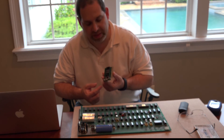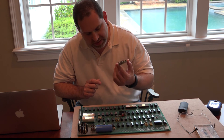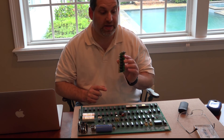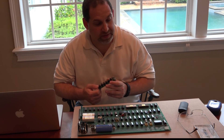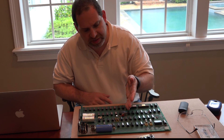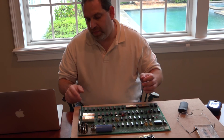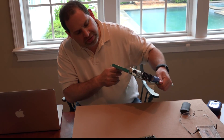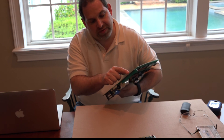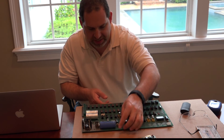There are different types of transistors than would normally be there, and we've got a date of 76-23 on the cassette adapter, and we know the cassette adapter came later anyway. The resistors are not the same spec as those we normally have in the cassette adapter, and the same labeling issue exists with the ROMs. Someone has also set up a switch to deal with memory so you can change the bank contiguously. The edge connector looks like it was put on by hand — they put the edge connector in, bent some tabs down, and soldered it by hand — so that part wasn't wave-soldered, but the actual chips were.